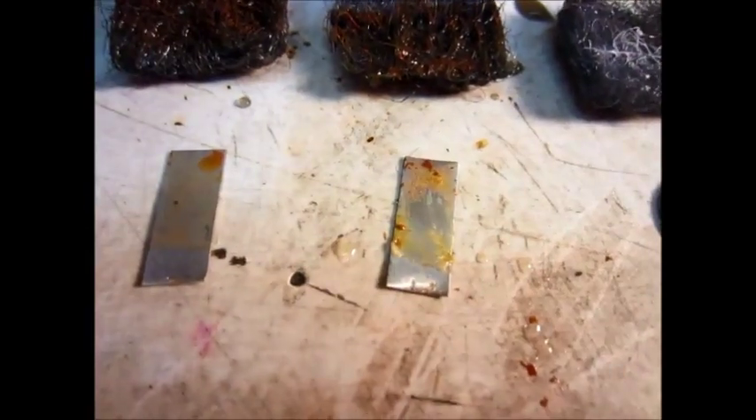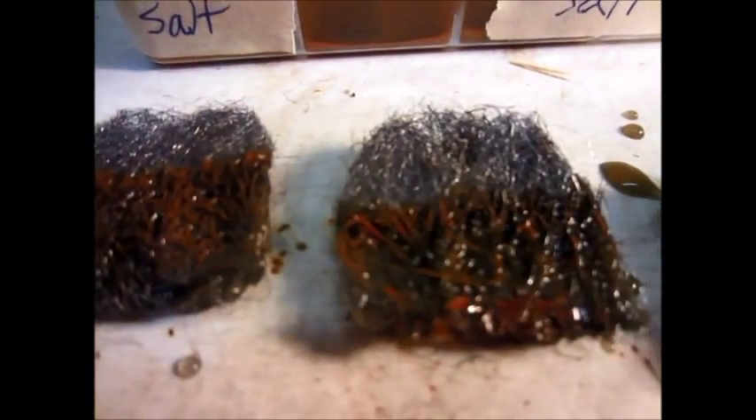The aluminum electrodes really don't look like they did anything at all, probably because aluminum gets a very thin oxide layer on it to protect it from corroding further. It corrodes really fast at first, but once that oxide layer is on there it doesn't corrode anymore. That probably caused it to not have much current going through it, acting like a barrier — so it didn't really corrode to protect the steel, and the steel got rusted anyway.